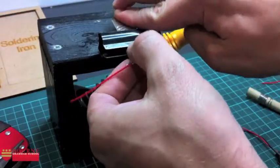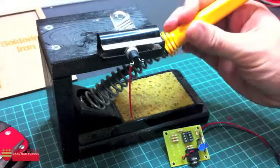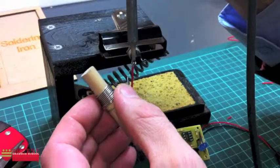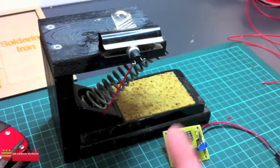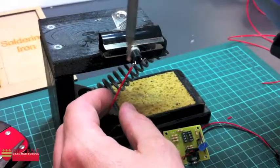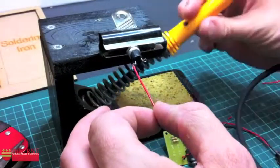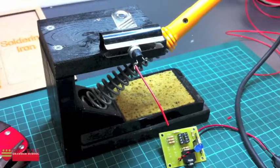You can then clamp your switch. Don't worry about the fact it's hanging down, that's fine. Get the soldering iron in from behind. Watch out for melting the black plastic on the back part of the switch. I'm notorious for doing it, and you can see when it's set because it suddenly locks in position. Look, what I tend to do with mine, because I'm a bit pedantic, is I do like to remelt the solder afterwards and just have it so it's sticking perfectly downwards, and just hold that just for a second while it dries so it sticks out like so.